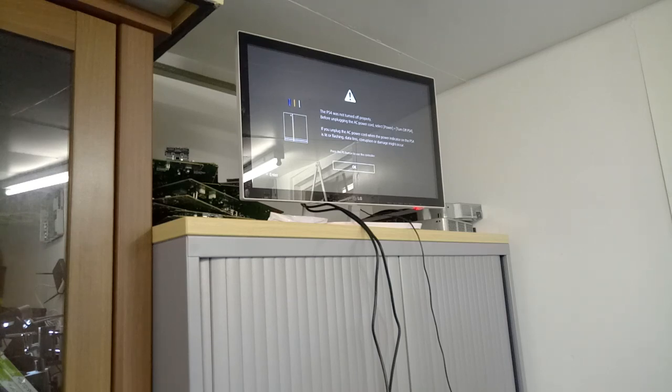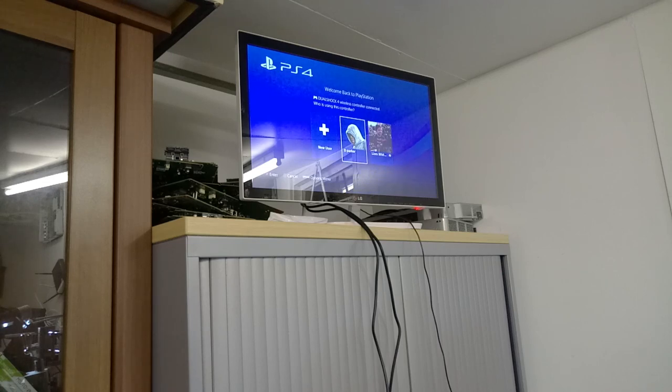So what we're going to do is just plug the controller in. This one has been sent up bare bones - I don't have an antenna for it. I'll just pop the controller on the top. So you can see there now - that's absolutely fine and we're going in and working quite nicely. So we're happy that we're good and that we're fixed. So we've ended up replacing the port again, changed a couple of bad EMI filters, changed out a bad encoder IC. We've replaced that little 2K resistor and the diode at the back of the port. That's all working nicely. So as you can see, we have a nice 1080p picture on our display. We can see safe mode so the low resolutions are working too. We're quite happy to call that a day and to call that a fix, ladies and gentlemen.